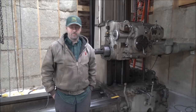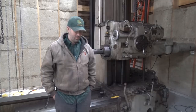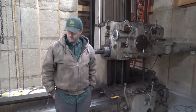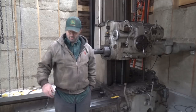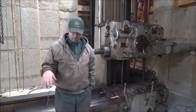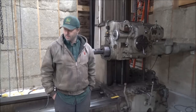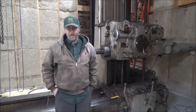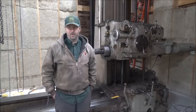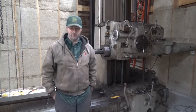I spent essentially an entire day putting these feet in here and getting all the nuts on them, getting them all fished up and screwed to where I had the correct amount of stud through the nut, because it can't stick up too high or they hit the floor that goes across, and you don't want them too low because you want good coverage of your threads through the nuts. So that's why I think it'd be a good idea to just make it more of a fixed length than what I did here. I just went off the foundation diagram, and that's a tip that they didn't give on there, but that's my tip to you all in case anybody does a project like this. Now you'll know, no more than twice the nut width in the box.